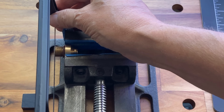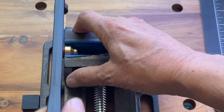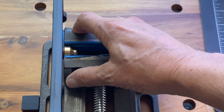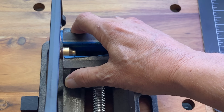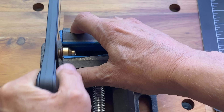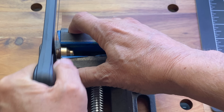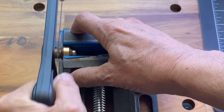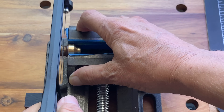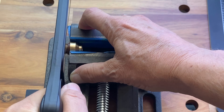For those of you that haven't used a hacksaw before, most hacksaw blades are designed so they only cut when pushing forward. The backstroke simply removes material that's accumulated on the front stroke's cut. Basically, take an easy cut so that I can try and keep it straight. The threads will want to throw it off at a bit of an angle, but I think we've got a pretty good straight slot started here. So we'll just keep moving along. Then we'll use a little hand vacuum to vacuum up the metal dust when we're done.